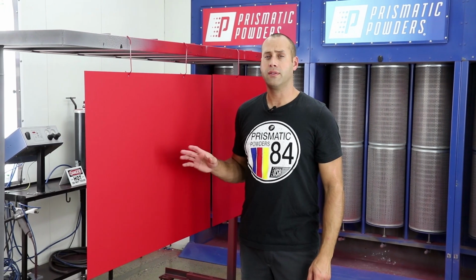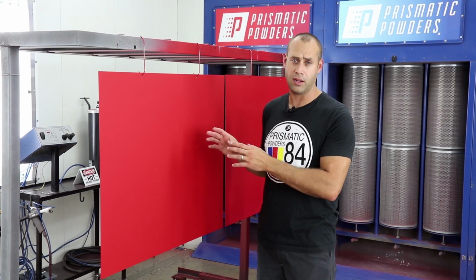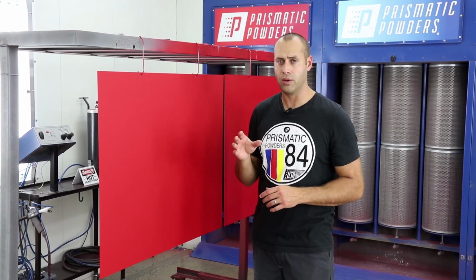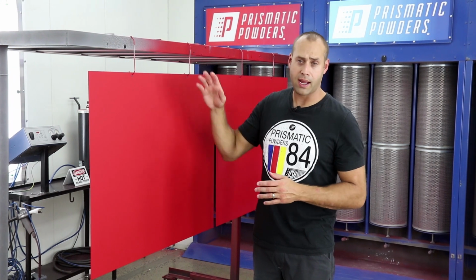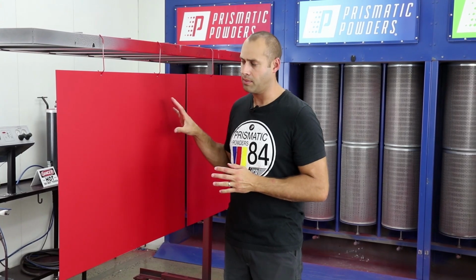So hopefully you found this video helpful. You don't have to do it exactly as we've done it here. The most important thing is that you develop a technique that works for you. Give yourself a chance to practice. If you haven't done these before, get a big piece like this, spray it out, try different gun settings, hand speed. All that is important and will affect the final outcome of the finish.